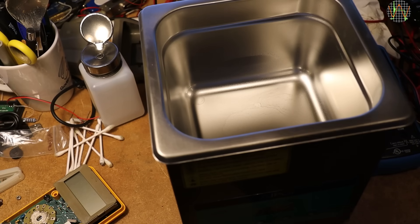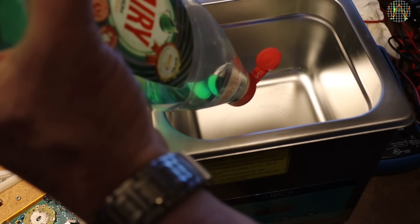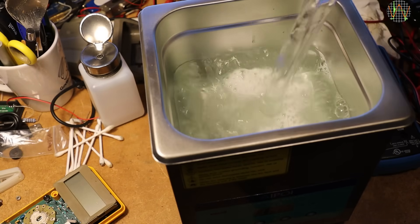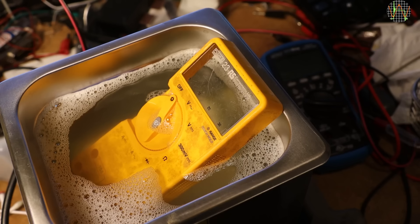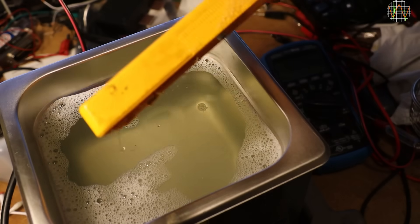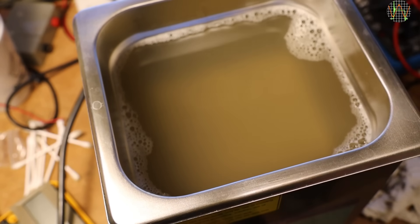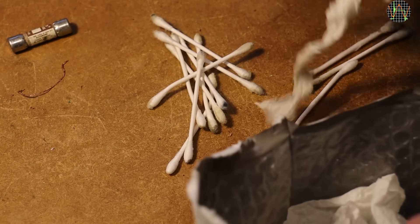The meter works but it is pretty yucky. Although ultrasonic cleaning is not ideal for plastics, I decided to give it a try using normal dishwashing soap and tap water, heated to about 40°C. After 10 minutes I turned the housing around and let it run for another 10 minutes. The result is a bit underwhelming but the water is definitely dirtier than before. I also ran the holster through the same bath. In addition, I worked on both the meter enclosure and holster using isopropyl alcohol soaked tissues and yet more cotton buds.